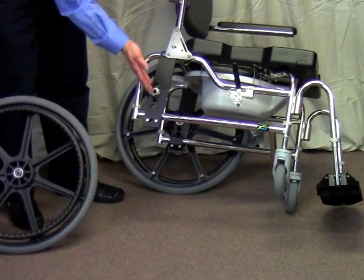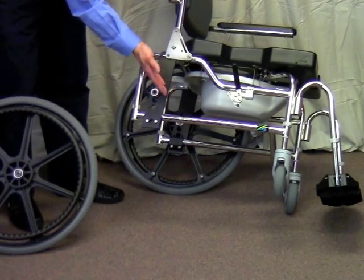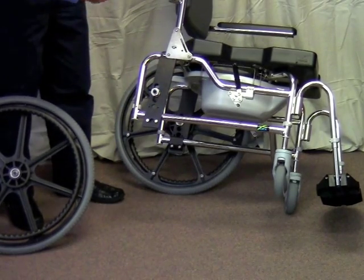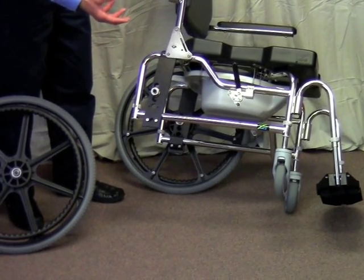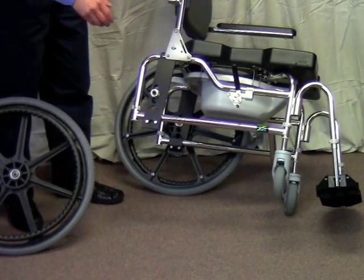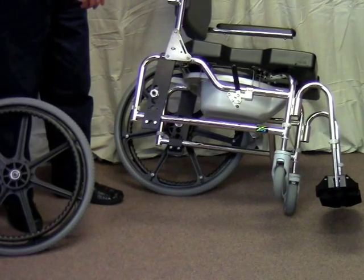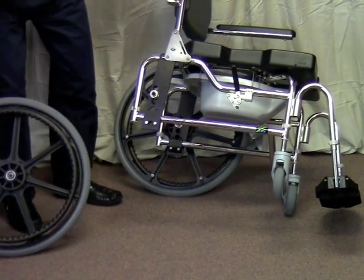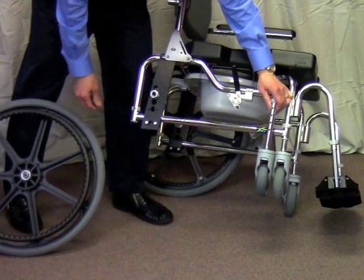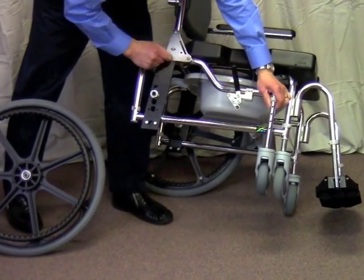I can slide up to 3 inches of axle plate, giving 3 inches of center of gravity adjustment, which is important for making the chair more maneuverable — whether it's over a threshold, over thick carpet in the bedroom, or to get up over a shower. Height adjustment in the front is done by telescoping out the front casters; you can see the series of holes here.